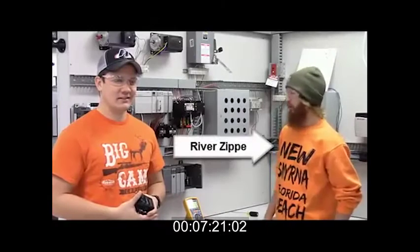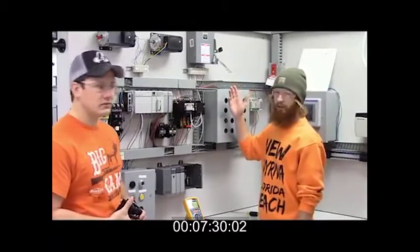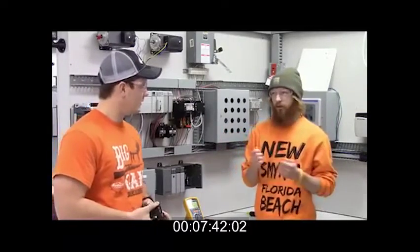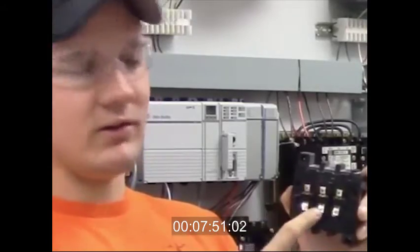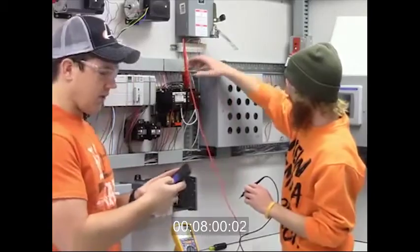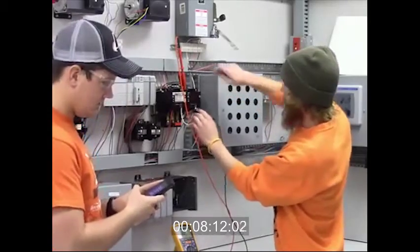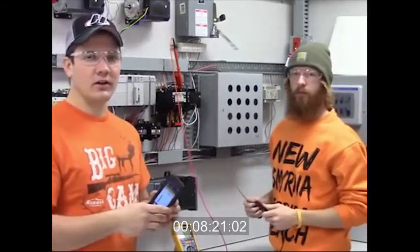My name is River and we're now going to measure the resistance across the load contacts. Now that the circuit has been locked out and tagged out, we take the three-step approach: measuring a known source, measuring the contacts again to make sure there's no power, then going back to the known source. What we're actually measuring here is the load contacts — you can see where L1, L2, and L3 make their connections. He's going to measure across the load contacts now. We're going to use the Fluke Connect equipment — I will be capturing the information on my phone while he is actually taking the measurements. Captured. Go ahead and move to L2. Captured. Now go ahead and move to L1. Captured. Now we have all the resistance across the load contacts on our database.